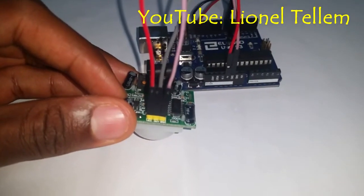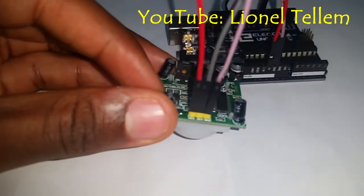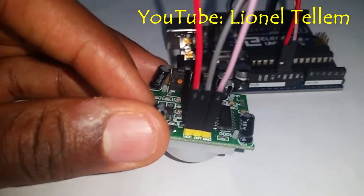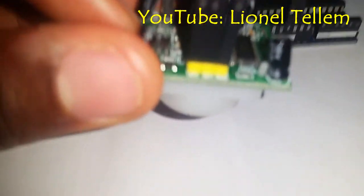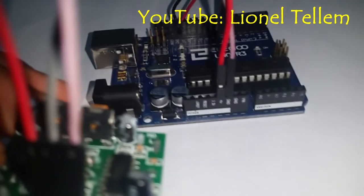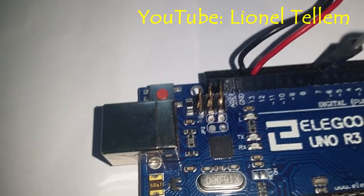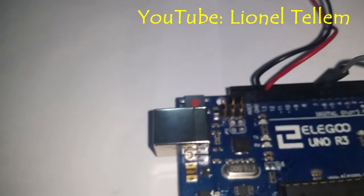The wiring is very simple. The red wire goes to VCC at our 5 volts. The output wire goes to digital pin 7. The ground goes to ground. To wire up the buzzer, simply put one leg on pin 13 and the other on ground. Now let's move on to the code.